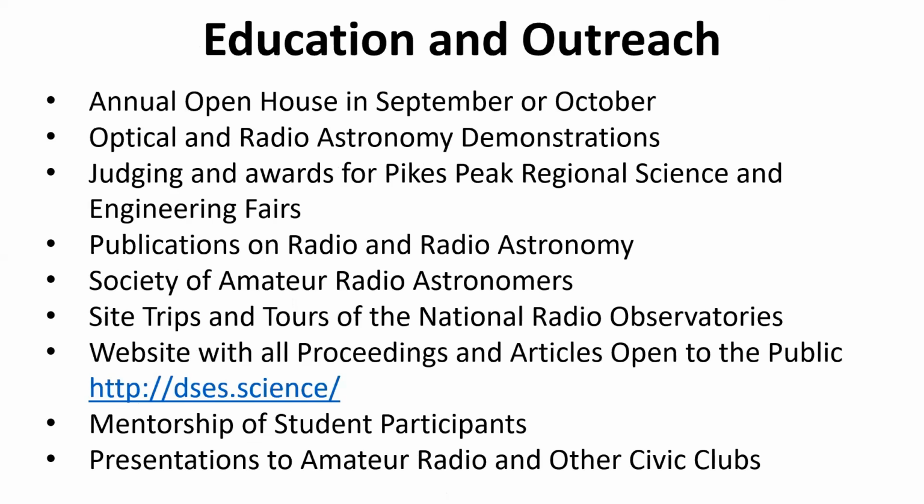Who has done EVE before, and when was it done? We don't know of anybody that's done it. No amateur group anyway. The two-way communication not done, just about hearing their own echo. They just did radar to measure the distance to Venus. Yeah, the German radio club did it with an 80-foot dish and, as Bill said, a 6.5 kilowatt Klystron, 2.4 gigahertz.